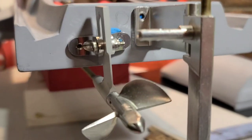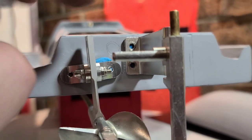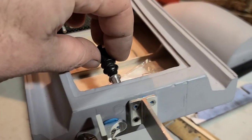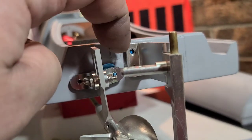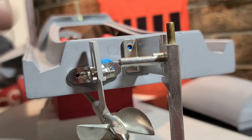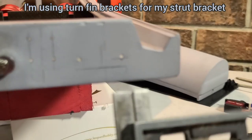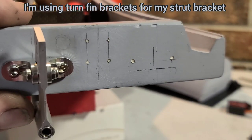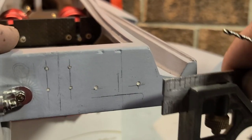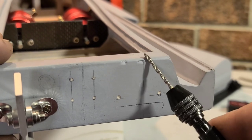I'm basically trying to figure out where I want to mount my strut on the transom. If I go low with my bracket on my strut, I'll have enough room for my bellow — I'm going to use a bellow for this build for my rudder, mounted from the inside. I use Loctite sticky putty — the kind you use to hang pictures — to set my hardware up on the boat so it doesn't fall off. It works really well. I got my transom all laid out, used my adjustable ruler to get the height on everything perfect, then used my pencil to mark out my holes and made sure everything was centered from both sides of the boat.